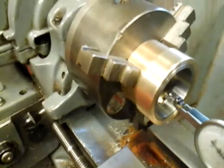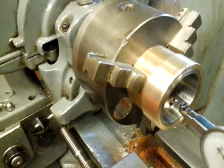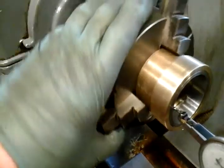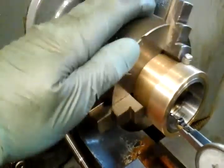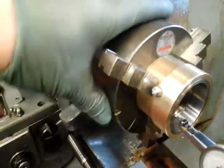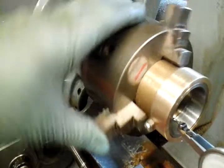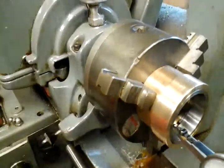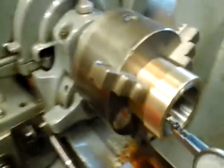My clock goes into the cam ring and then I determine where all these lobes are coming into and out of play in relationship to those grooves. It's taken me quite a while to get this right because it's a bit intricate, and like I said I've got no drawings to work to — I'm just working from an original cam ring.